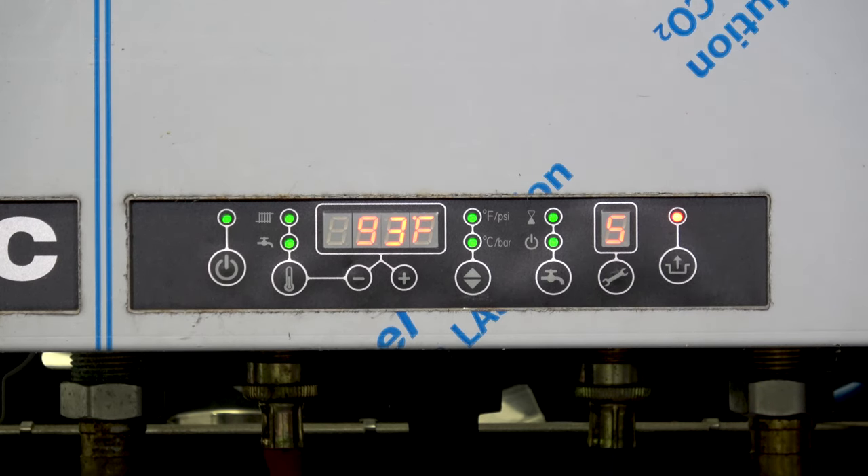The next option is capital L. On the indirect hot water heaters we get from IBC, there's a temperature sensor inside. When you wire that temperature sensor into the boiler, the boiler becomes the aquastat and we control the temperature inside the indirect hot water heater from the boiler. Here we're setting the high limit for that indirect hot water heater — in this case we will not have water any higher than 140 degrees. We set our target temperature in another place, which we'll show in a minute.